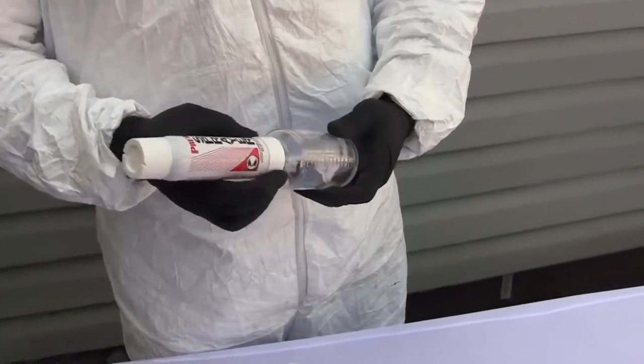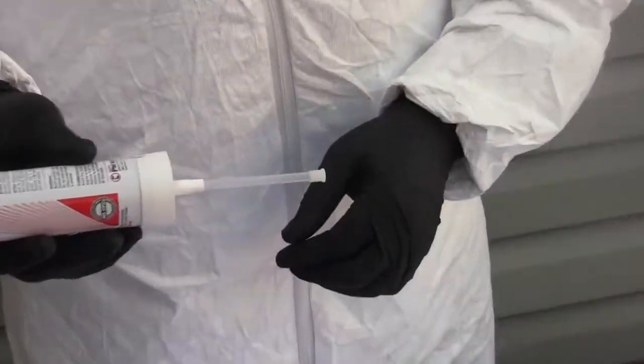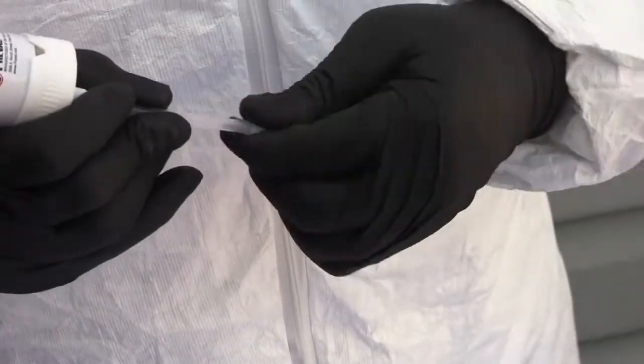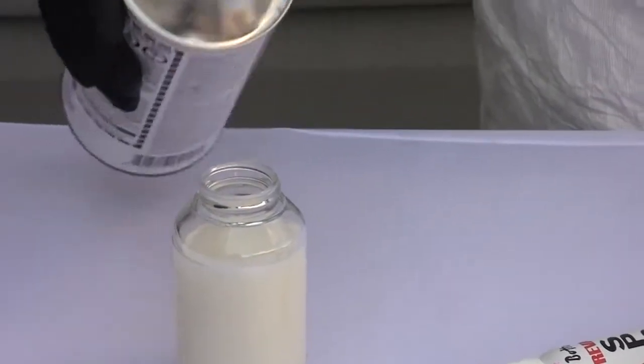Before using the mini sprayer, remove and dispose of the filter on the bottom of the intake tube. This filter is designed to remove solids from paints, but is not necessary for applying Ultra EverDry, and if not removed, may cause clogging issues during the application process. Once the bottom coat has been mixed, fill the jar no higher than the fill line marked on the jar.